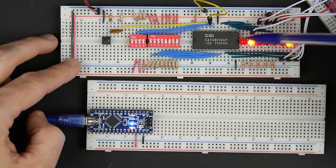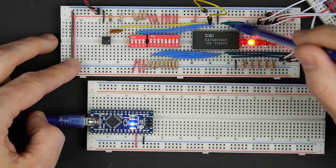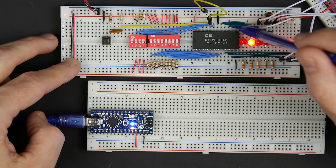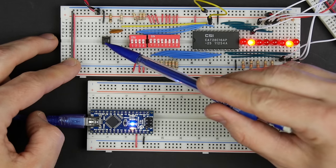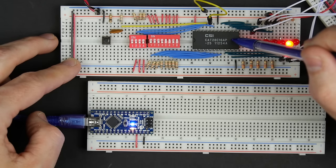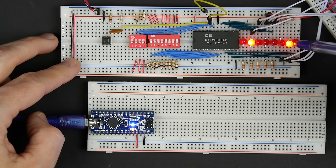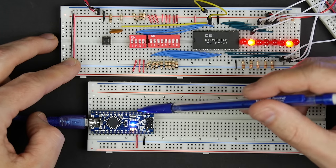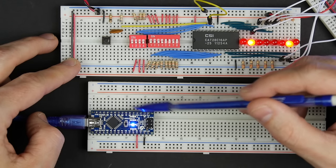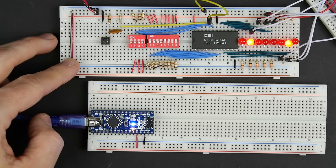And so you could say, well, we definitely need to be able to control the 8 data pins, because that's where we have to write all 8 at the same time when we hit this write signal. All 8 of these bits are getting written to the chip at the same time. So we definitely need 8 data signals. But we've only got 12 here, so if we use 8 of them for our data signal going into the chip, then that only leaves us with 4 additional lines. But fortunately, there is a solution here.